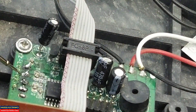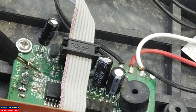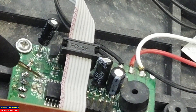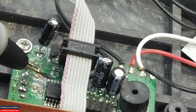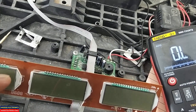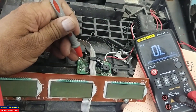This is the first input terminal and this is the second input terminal. The terminal signal reaches here, where we have a 51-ohm resistance. The signal enters from this point, goes through, and then comes to the next pin. We must measure 51-ohm resistance between these terminals.